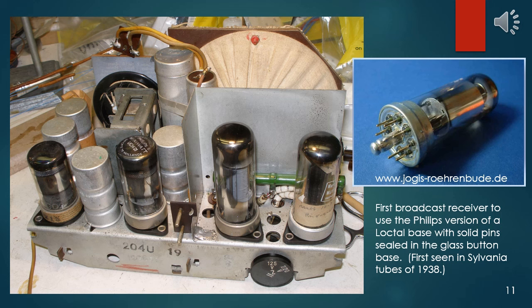The walls of this center socket location often become cracked. This was true at one of the replaced tubes. Fortunately, the pieces remained and were glued in place with CA adhesive. If I had to do it over again, I would consider using rubber-filled CA adhesive. It should be more forgiving of stress. With only this minor repair, the radio remains an accurate historical reference as to the original construction of the product.